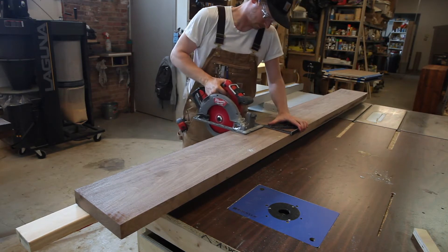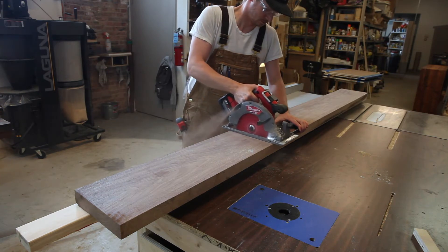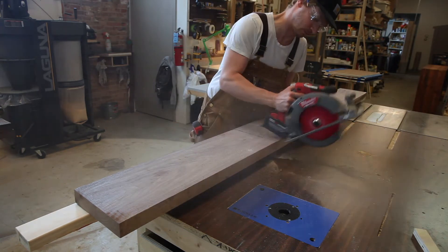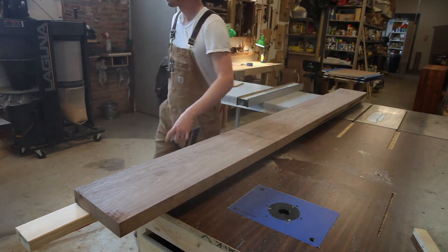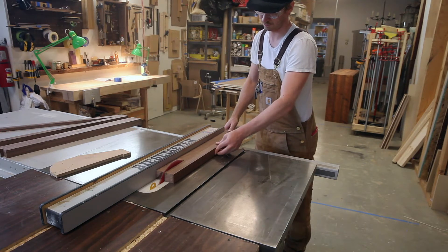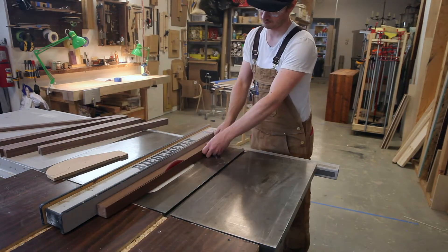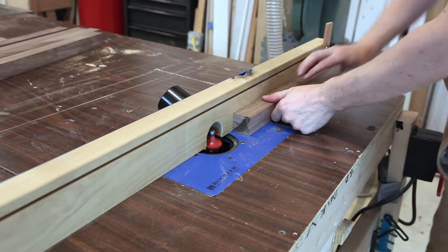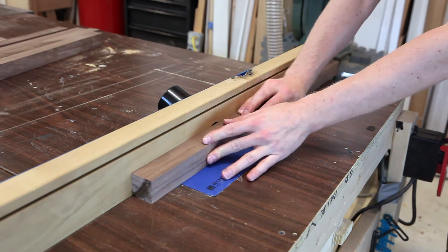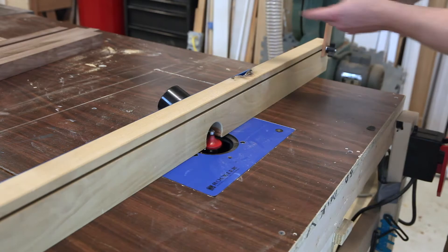Using solid wood at the corners actually ended up making my life a little easier for the glue-up. Instead of trying to fight and miter the corners of the base, I just fastened solid walnut strips to each end and glued them on using biscuits. It's a pretty efficient way to do it. What wasn't efficient was rounding over the walnut corners before gluing up — I didn't think about it, but I lost some bearing surface for my clamps, which made the glue-up a little more difficult.